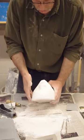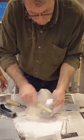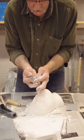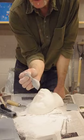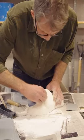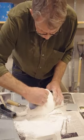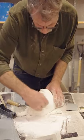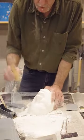With the sandpaper, what we want to do — if we want to get in there — is we have to really bend the sandpaper so that we have a shape that's very similar to the area we're going to work in, and then very carefully work away at that surface. The majority of the material — the bulk — is taken off with tools like these.